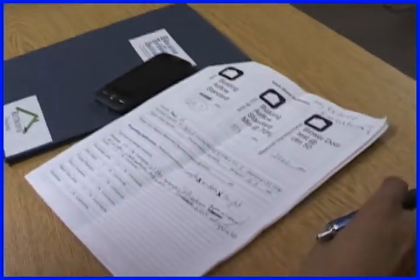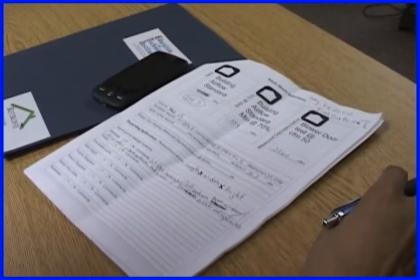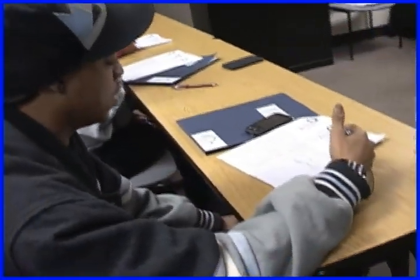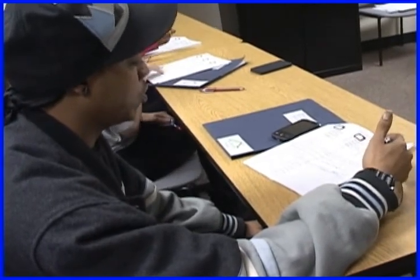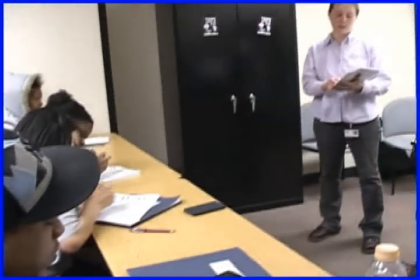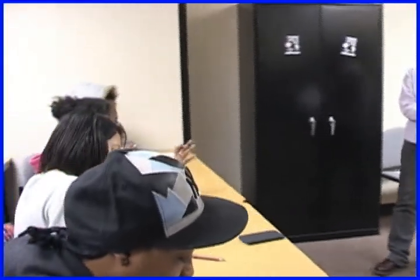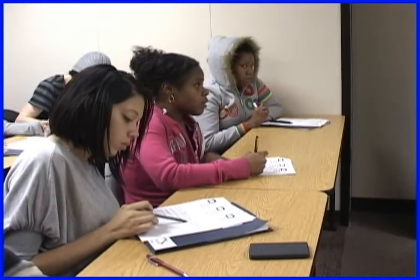So you multiply that times 0.35, divided by 60, which gives you 49.28. And you take the 49.28 and multiply that times your N factor, which is 16.2. As we move down to the next line, you just take the answer from the previous line, which was the 49.28. That 30 was just another, less approximate way to figure it out if we didn't have the volume.